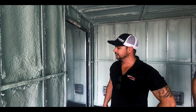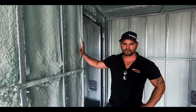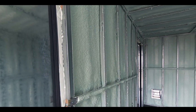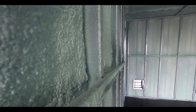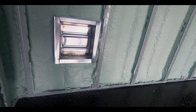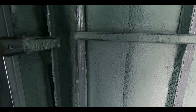I'm from Comfort Insulation and I came just to check the spray foam that the guys did today in this container. This is a 20-foot standard container. We use two-pound foam on the exterior cavity. Two inches is the minimum required for a vapor barrier. As you can see, the framing is very well done, so we can have a continuous vapor barrier in every corner and we don't have any gaps whatsoever. This is pretty much what we're looking for — making sure that the container is sealed 100% and you don't have any kind of condensation happening in winter.